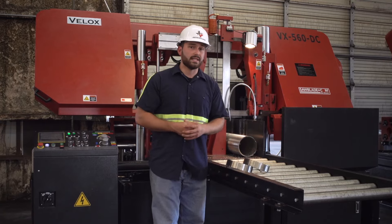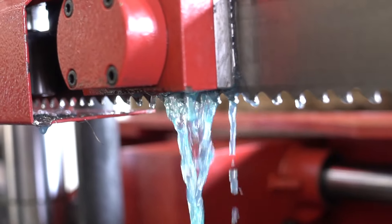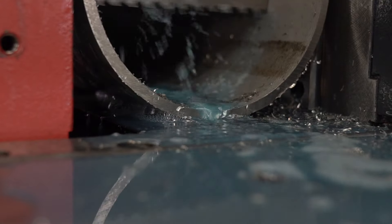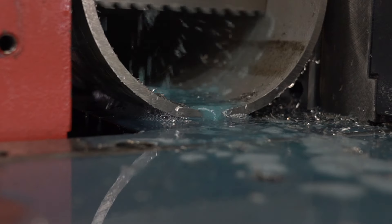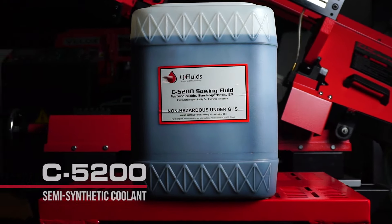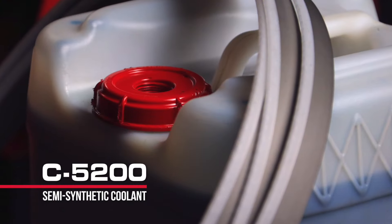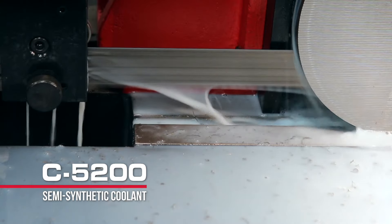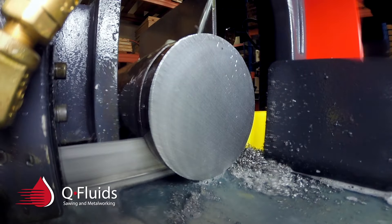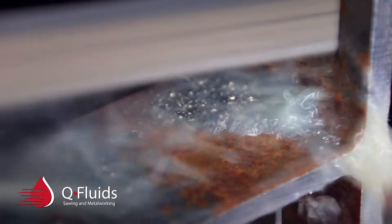What's also going to aid us in the cutting process is the use of cutting fluid. Especially in such an abrasive material, you're going to want good lubricators to keep the heat and the chip away from the material and the blade. We're going to be using sawblade.com's C5200 semi-synthetic sawing fluid. The C5200 is a great all-around coolant that is heavy duty and industrial for use in a high-production situation like Houston Metal Sawing. It's got good lubricators, a good detergent package, and it's going to keep the blade and the material cool during the cutting process.